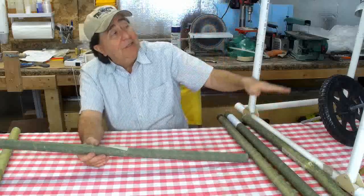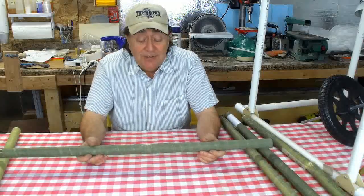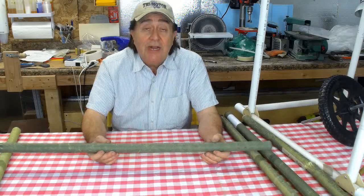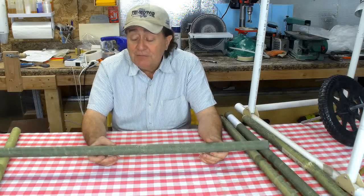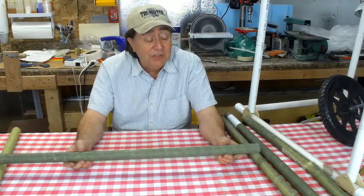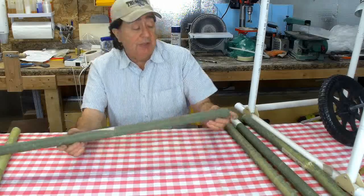And for the whole pilot's cage, I'm okay with that. I'll save 4 ounces somewhere else and 4 ounces somewhere else, and I got these 8 ounces covered. And still, I think that this tubing could be susceptible to local buckling due to ground handling boo-boos. Somebody steps on it, you hit a rock, somebody trips and falls and bumps their head into it. Things like that could happen. And the aircraft can't be a flying eggshell. It has to withstand some handling on the ground and so forth. So this is a compromise between absolute minimum weight and usability.